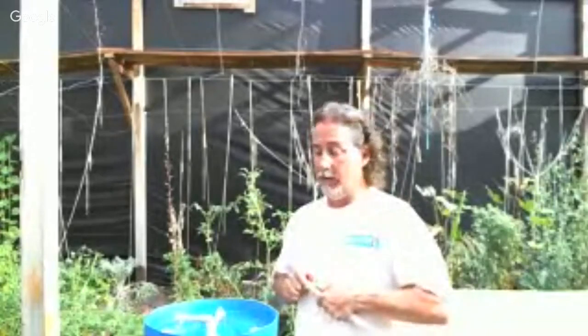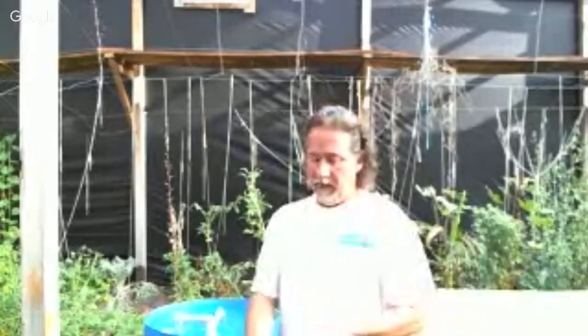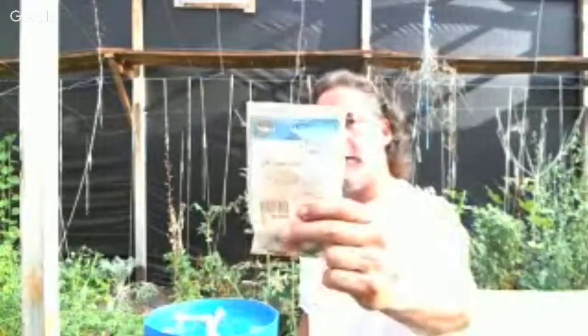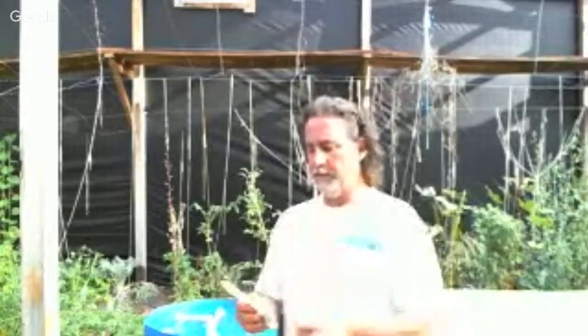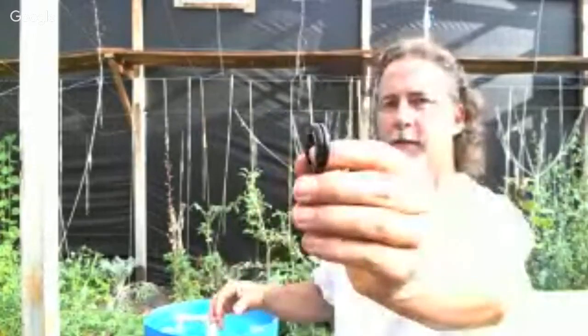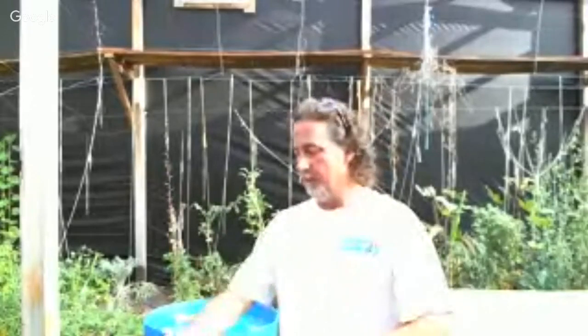If y'all want me to do that one day, I'll show you. It's not really necessary, but I got these grommets from Granger, and if you want to go through the side of a barrel or anything, these grommets work. It's part number 774136G. I'll try to show you a little closer. These came from Granger. You work these into the side, bottom, or top of the barrel so that the plastic sits in the groove, and it's completely sealed around there. Then you work your PVC pipe through, and you have a sealed fitting. That's how these grommets work.